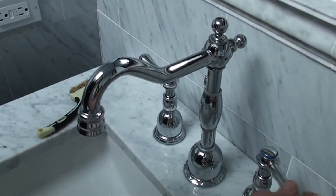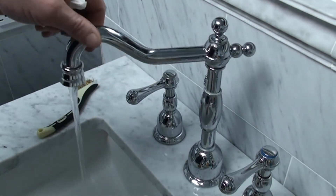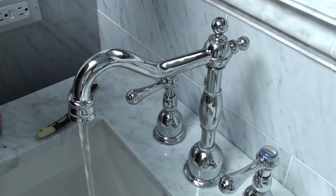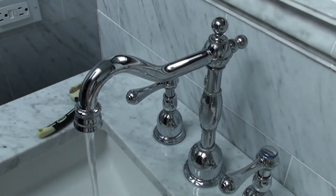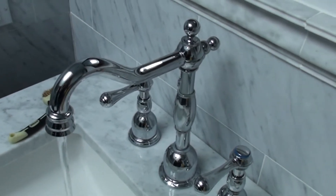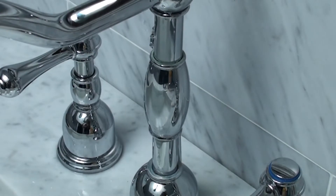Although I do have a lot of water on the countertop that I haven't cleaned up yet, I don't have a proper large paper towel or rag with me — I do have them in the truck and I will clean up, because I never leave a mess. But I am going to clean up this fixture so I can observe any leaks. No leak. Okay, we got the water on full — I don't see any trouble. I mean, it was really pissing out before. I guess it was a faulty O-ring, just as I suspected. And that's the joint where everything was leaking out before.